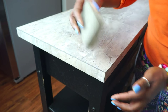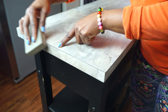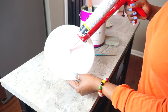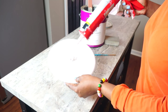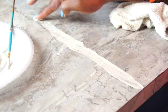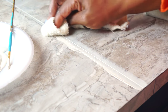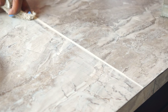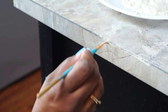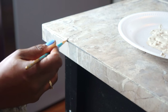Now that we're done with the tile application, sometimes the tiles can have sharp edges, so you'll want to sand them down gently with a medium sanding block. After sanding, wipe off any dust. You want to fill any cracks or gaps so that water doesn't get up underneath the tiles to lift them. I'm just tinting my painter's caulk that I'm going to put in the cracks. This goes so much better using your finger. And you can tint your painter's caulk with any paint color that's going to match your tile — I'm using my kitchen wall color because it was a very good match. And now you just want to take a little bit of your paint and touch up those raw edges. It just makes it look better. You want to make sure that you wipe up all of the excess off of the tile.